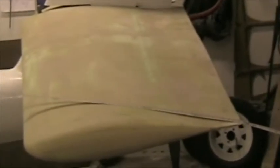We've also put in the front tube for the front attach point. There you can see the 12 millimeter inside diameter mild steel tube, which is bonded in place with cotton flocks. And the tailplane's in position, and just to make sure that it's all straight whilst the cotton flock is setting, let's make a few measurements.